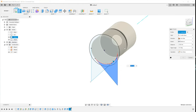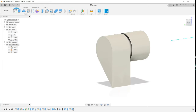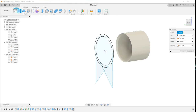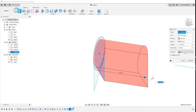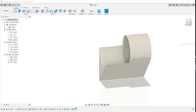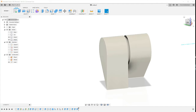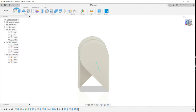Let's extrude over the length of that piece — looks good, join. Bring the sketch back, hide the first part, and extrude the second hinge component to the back. Now we have two hinge components that can actually join to things and can actually be printed. If these were attached to something, you wouldn't worry about those overhangs anymore.